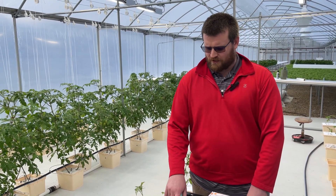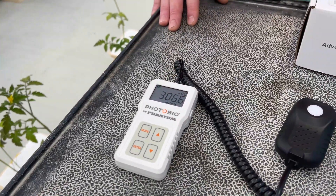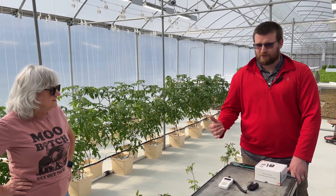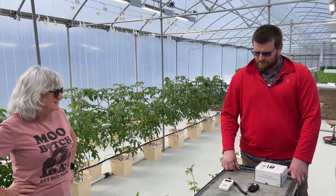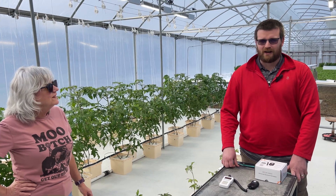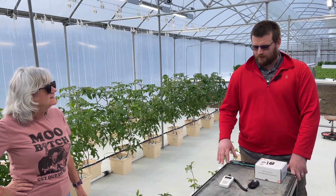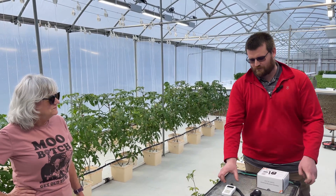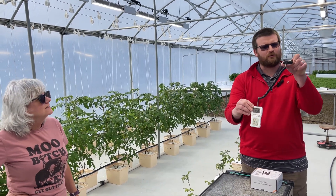We turned the lights up to 80% and picked up to 323. Then we'll go ahead and crank them up to 100%, but we're getting a lot of influence from the outside sun, so I'll have to keep waiting for clouds for better accurate readings. I think you're fine at 60% based on what we got at 250, because that was what we were targeting — 250 to 300 PAR at crop level. As this crop grows up, the light intensity should increase as it gets closer to the light.